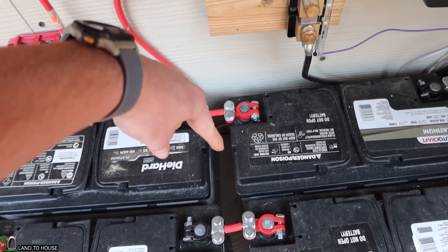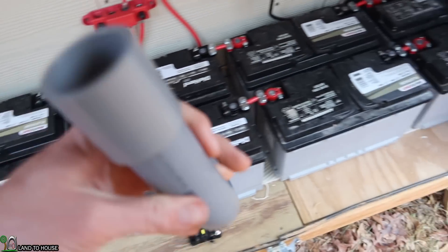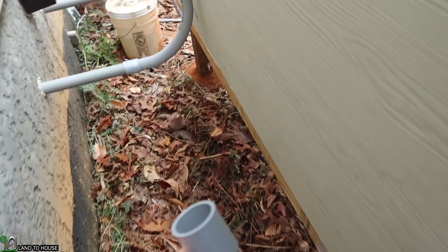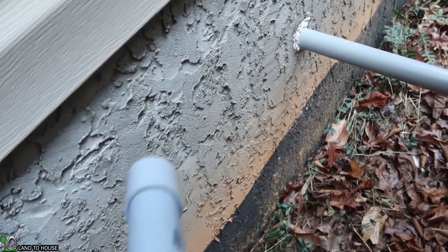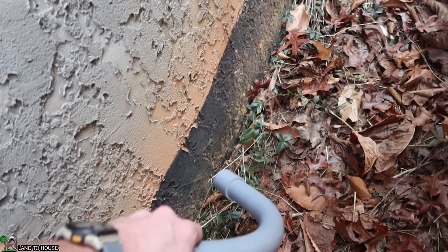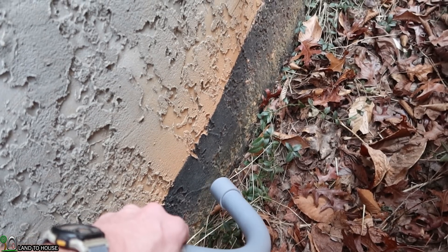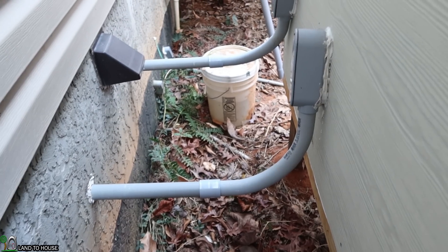What I'm going to do is drill a hole down into the floor of this little power shed and install a one-and-a-quarter inch piece of conduit pipe. This piece will be sticking up right here. That's going to allow me to take this 90-degree piece down. The reason I'm going so low is because I'm going to mount the battery up here to make my seven-foot cable reach from inside the building to where the battery is going to be. So we need to go under the house and find this spot and start drilling a hole that will allow the inch-and-a-quarter conduit to reach through.